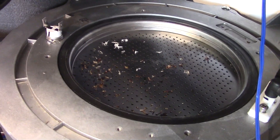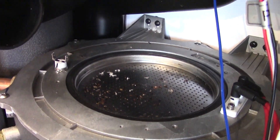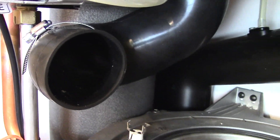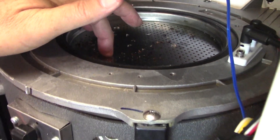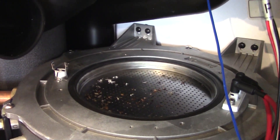A lot of times contractors are not cleaning their PVC shavings or PVC pipe when installing the combustion air intake. Where does that end up? It comes down the combustion air boot through the blower and the top of the burner. Ken will pull the burner and we'll get a look at that — but that will plug up your burner.